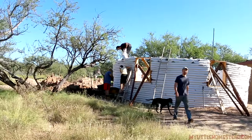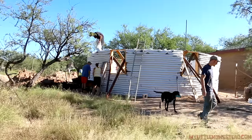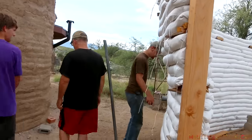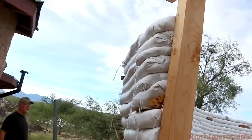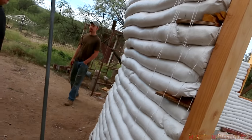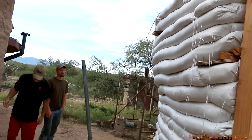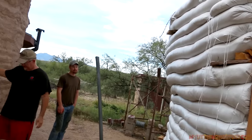A 30-foot circle on a 14-inch bag is the absolute max you'd ever want to do. We didn't really know that going in — we didn't think it would matter because we've had such good luck with smaller circles. Once we got up to a certain height, we had issues setting the walls and our center line got a little shorter at one point, bringing the walls in and out. Then a big rain came through, soaked the bags all the way down to the bottom one, caused a lot of weakening, and it started to buckle. If we would have put buttresses in, we wouldn't have had these problems.